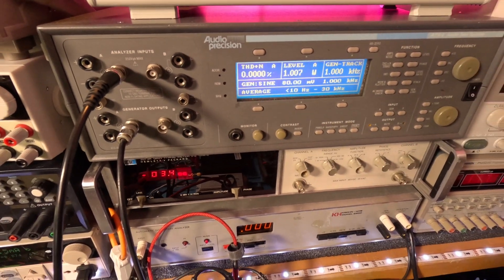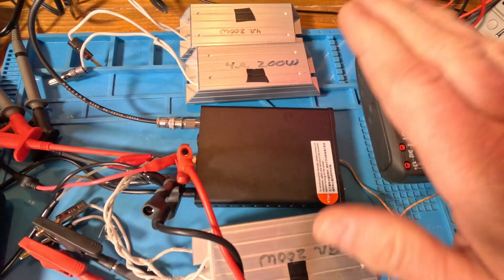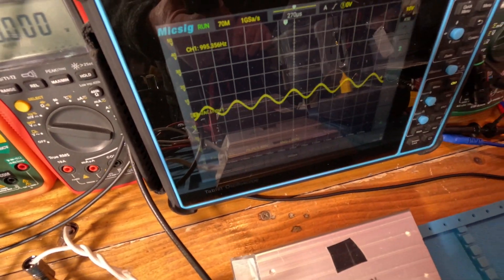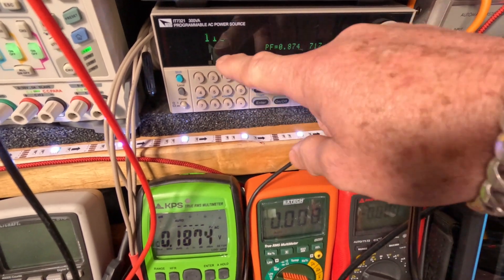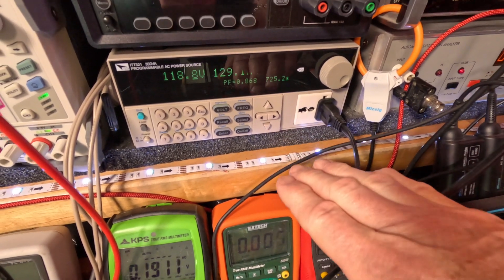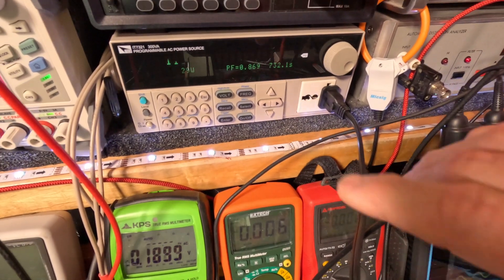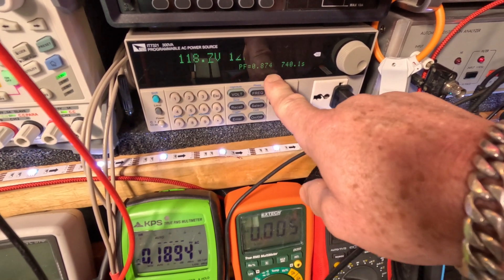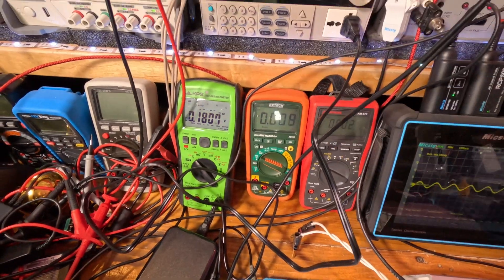Now look at that distortion — it's like essentially zero. The amplifier is right here and it's a little bit warm, 42 degrees, because I was at 190 watts but it dropped down. Resistors are scorching hot and they're going to start cooling down. That's our signal at one watt. Now look at this — this is 13.3 watts. Remember nine watts with nothing, so an extra four watts right now with one watt out. The efficiency is terrible because the level is so low — we have a lot of headroom and the nine watts overhead means the efficiency at low amplitudes is much lower, though we don't care because we're only dissipating a few watts. But power factor is 0.87 — not as good at low input power.